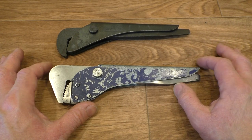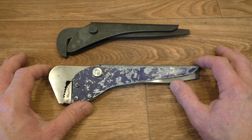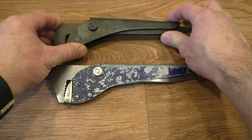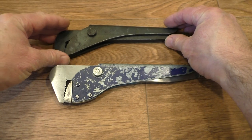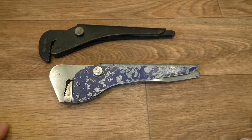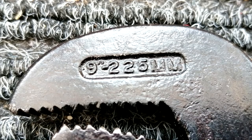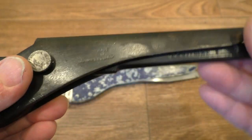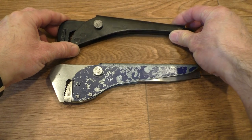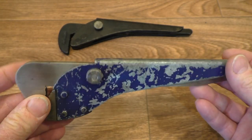I would say Mr. or Miss Knot made this piece possibly in the 1940s, possibly the 1950s or even the 1960s. As I say, we think it's pre-metrication because this is a quarter BSF thread on here. During the 1970s — possibly late 60s, early 70s — Footprint moved along to metrication. You can see here this one says 225mm in the hook or 9 inches, and we have a metric thread in there. So this, as I say, is 40s, 50s, or 60s — that's when I would say this tool was made.